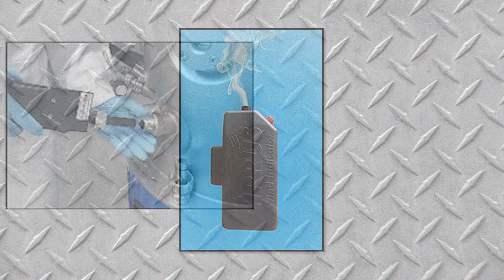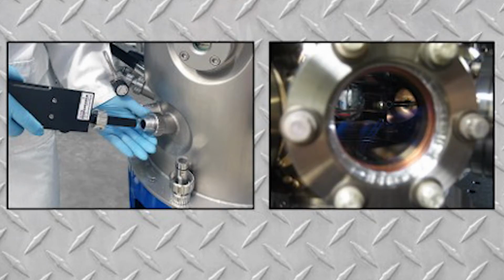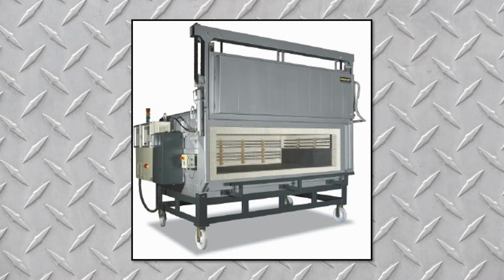flow is going. There are multiple access points which can be used for sensors or measuring devices, although some of these are just for material loading or viewports. These are openings that exist, but they don't always have to be open. One of the things we look for is if your coverings on furnaces are just removed for the convenience of the operators. This includes lids on vats and doors on furnaces.